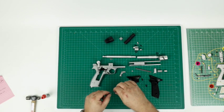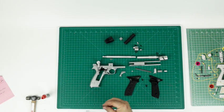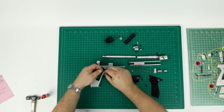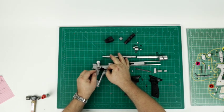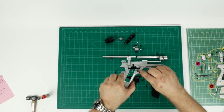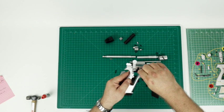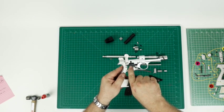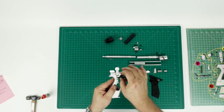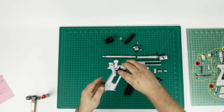Next part, a little tricky — it's another clock spring. Hold on to it; they want to fly off. The short end is going to go against the back wall of the trigger housing, and it goes underneath the linkage. Put it on the dowel just like that. This end has a catch on it like a little cup — come down here, bend it back, and it goes up under this linkage. That's what keeps the tension underneath the sear. It won't pop off once the grips are on, because the grips hold this down.